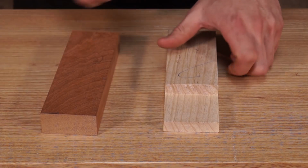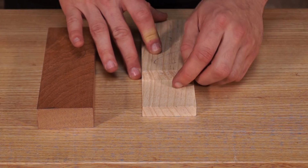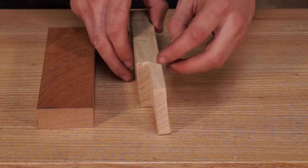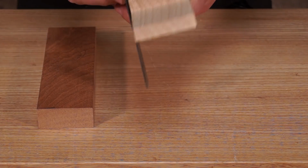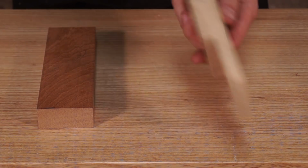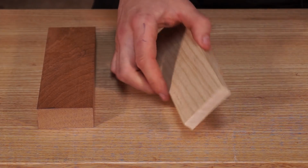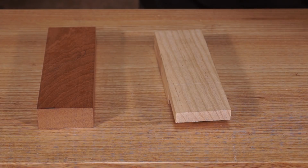So, thing to note here, I said that the preparation of this joint is very similar to a corner halving joint, which it is. The only difference is you have to square that shoulder line all the way around on all four faces. So again, when you're doing that, make sure that you're referencing it off that face side at all times. And when it comes to squaring this one across, you're squaring it off your face edge. Do not do it off the other one because that will mean that it's not accurate. So that is squared round on all four sides. And now we can start marking out the dovetail.